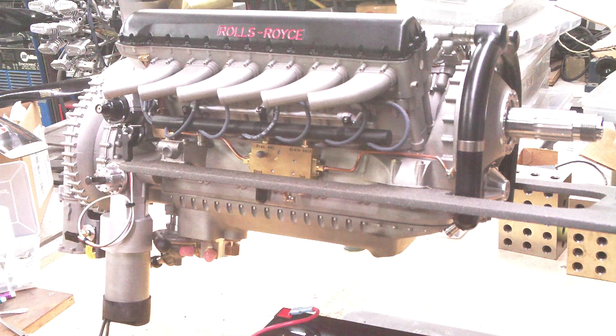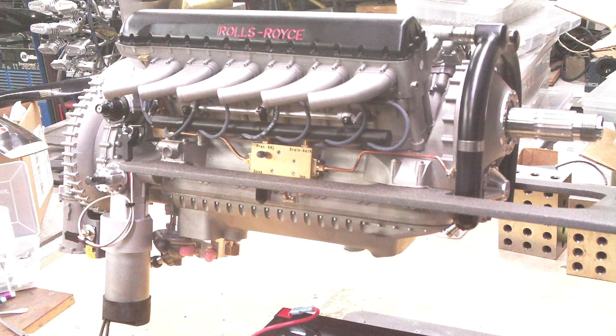There's a step-down gear ratio of 5 to 1 between this shaft and the crankshaft. Although the spark plugs are in the engine for this test, there's still some significant loads yet to be added, including the loaded oil and coolant pumps, as well as the inertial load of the fairly large four-bladed prop that still needs to be added.